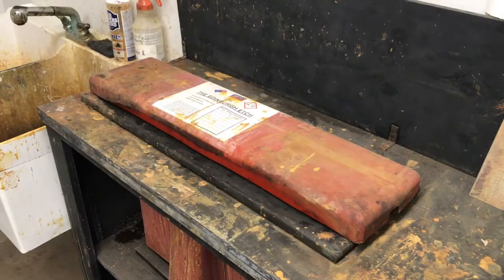This is our current ferric chloride etching bath. It's also referred to as an Edinburgh etch because it has a little bit of citric acid mixed in with warm water and the ferric chloride. And what the citric acid does is it eats away at the mineral deposits and detritus that's created by the ferric chloride as it etches the copper.